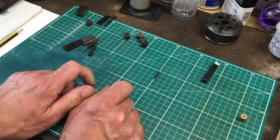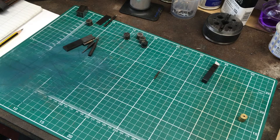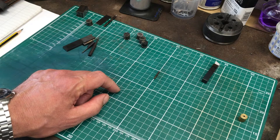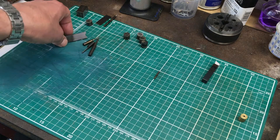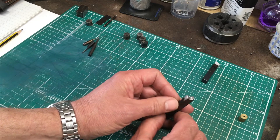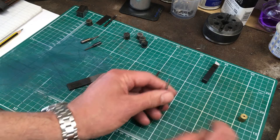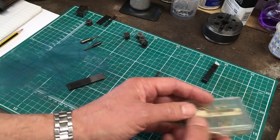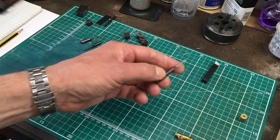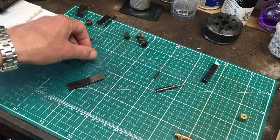Let's talk about why we want to harden things in the home workshop. Mostly it's because we want a one-off tool — it's too expensive to buy, or we want it now and don't want to wait to order it. It might be a form tool used for generating radiuses on the lathe, or taper reamers used for making drain cocks. The point is they're usually for one-offs or short runs and you don't really need anything terribly sophisticated to make them.